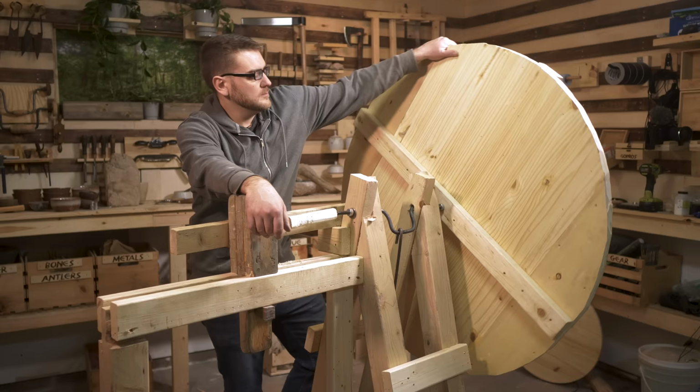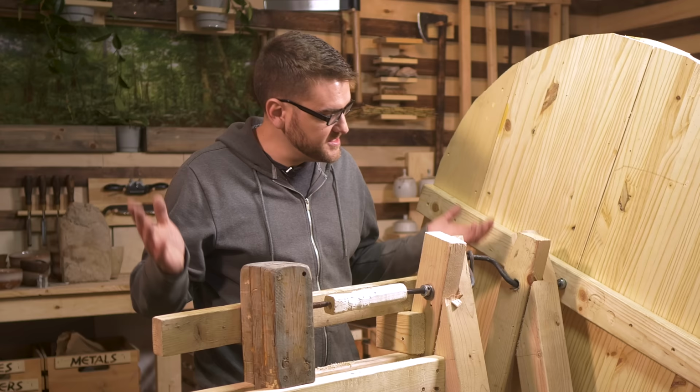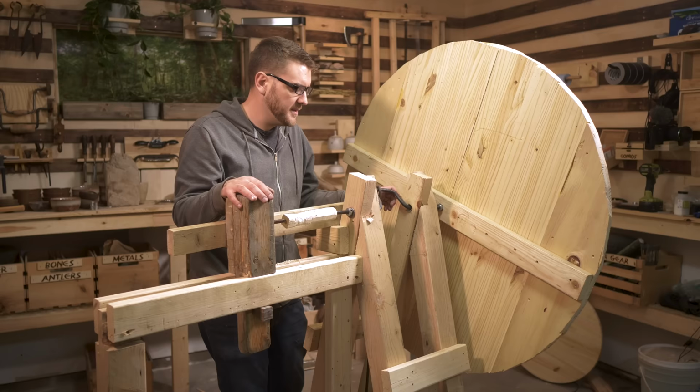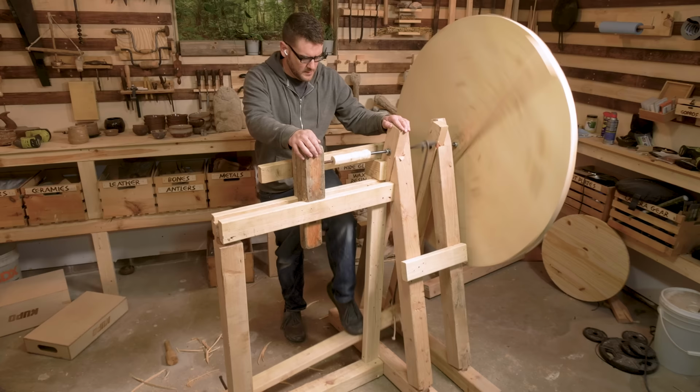It's a bit of effort to get going. But this is it. This is basically what he sketched. This is Leonardo's lathe, and I have to say it does work. And the biggest shortcoming I'd say to this is that it's what we call a direct drive, that the speed of the flywheel is how fast our actual object goes when we lathe on it.